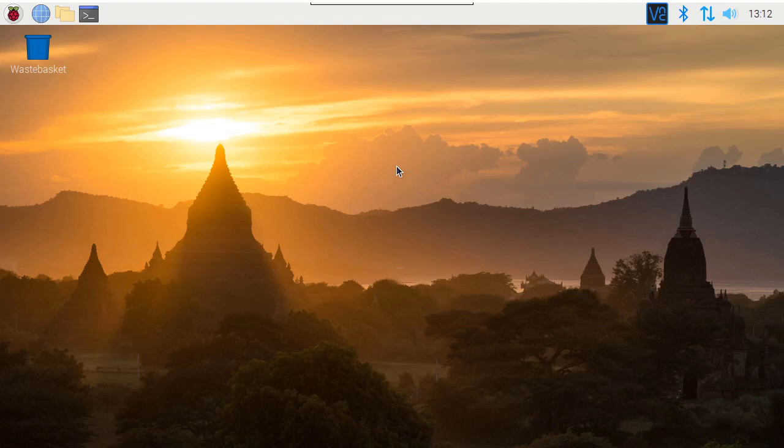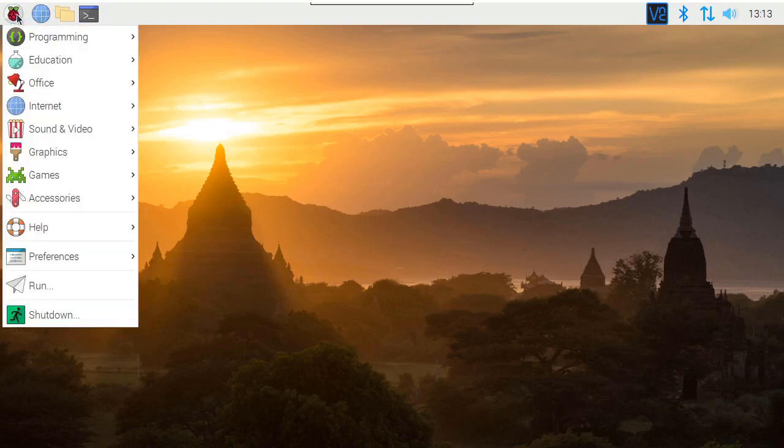So now what we need to do is we need to take the SD card out of the Raspberry Pi and we need to make an image of that SD card, which we can then apply to other SD cards, so straight away, when it's applied, we don't have to do any configuration work. We've done it now and we're just going to make an image of that configuration default state. So let's just see what we've got.